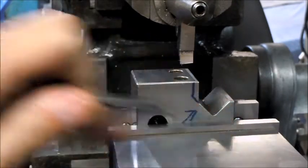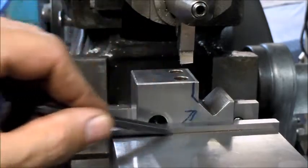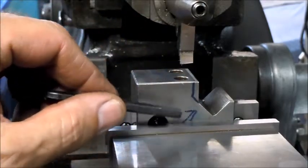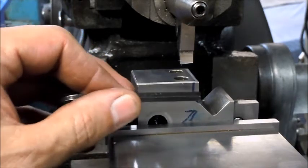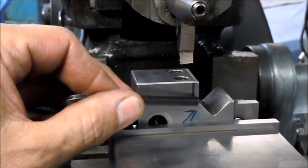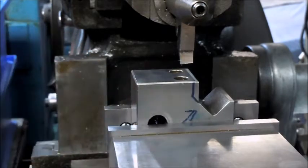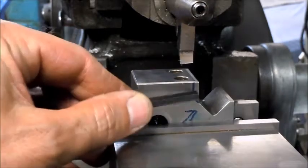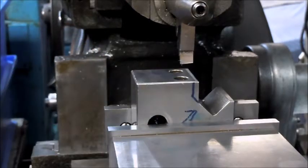So I've got it clamped up in the vise here, and I've trammed the back of the moving jaw here. I got that 0-0 and got the vise locked down. And I've just dialed over about 125 thou, and I'm going to take that down and I may actually even take that down square and just relieve it. See when we get down there.